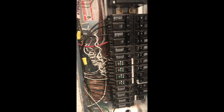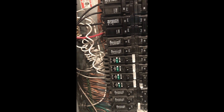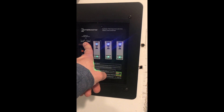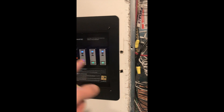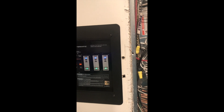You can see the ground went into the grounding unit and the neutral into the bus up there. Then I powered on the Intermatic surge protector. The controls are on and I have all the indicator lights up. You can monitor it to make sure all those modules are still working. The nice thing about this Intermatic is that those modules can be individually changed out if you do have a surge, so you don't have to change out the whole unit, which is what happens with some other units.